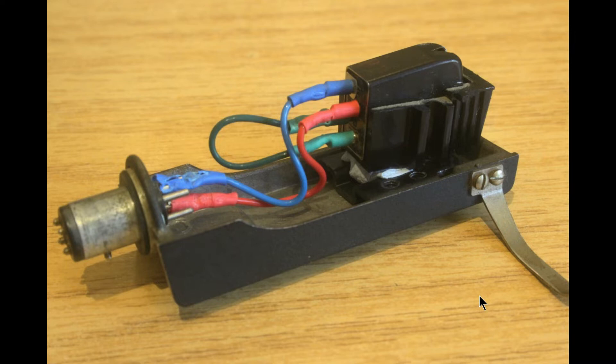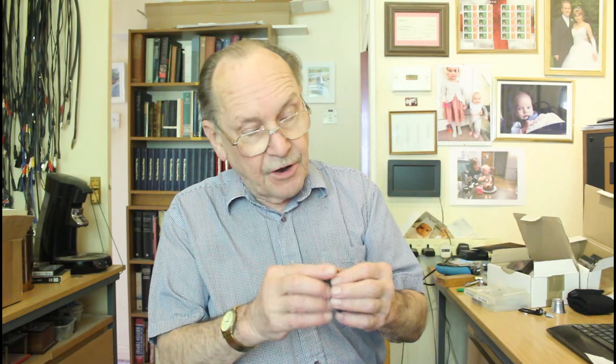We've shoehorned the cartridge into an old Sony head shell. The green lead, which was at the top, is now at the bottom. The left ground — the red one — goes round into the top left-hand contact. The earth goes to the other pin. We're putting our output on the left-hand channel; the two remaining pins are empty and not used. Unfortunately I haven't got a stylus that fits this particular cartridge — it's an M75 and the generic 78 styli I have won't fit because this M75 is in a different body.